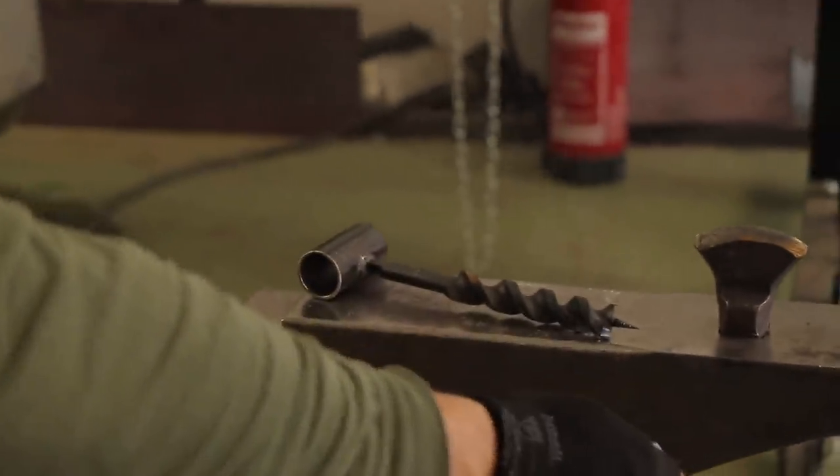Et voilà, c'est fini! The auger was complete. Alec and Mike reflected on the experience — it involved about three different approaches, lots of trial and error, but they got there. The key lesson: simply twist the bar first and then grind the tip, rather than trying to forge too much of it. Mike plans to put the finished auger to the test in a couple of videos' time. In the meantime, head over to Alec's channel — link in the description — hit subscribe for plenty of blacksmithing content, including some older videos they made together.